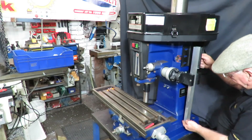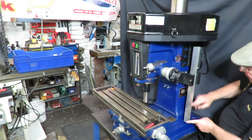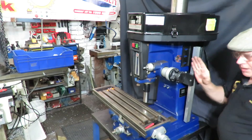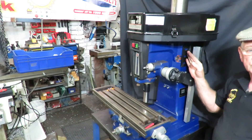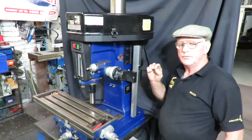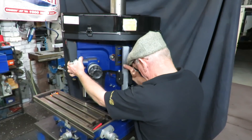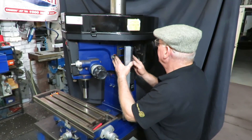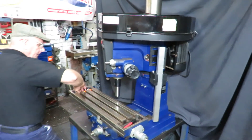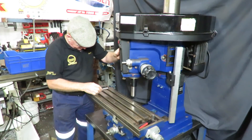We've got a bit of clearance here - we can lift it even a fraction more to give us the movement we need for the head above. Now we've got slots here. I'm providing three bolts, but if somebody wants to they can fit more in. Take into account this is a casting - it's cast iron - so be very careful with the drilling and tapping. We can turn this around a bit to show. That's in position, that's all held up. We could even lock that up a little bit more - lock that clamp.